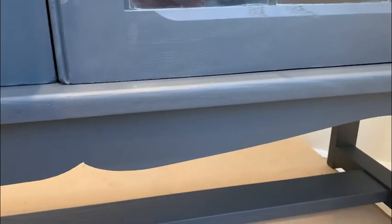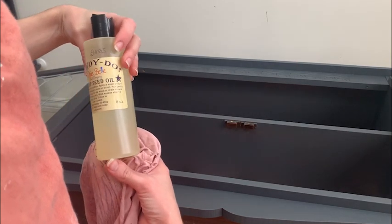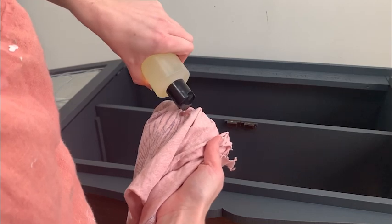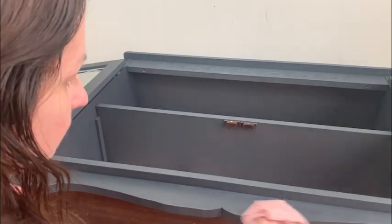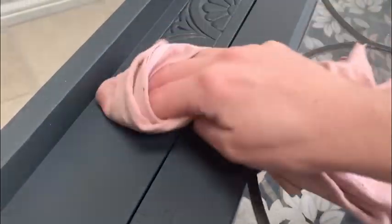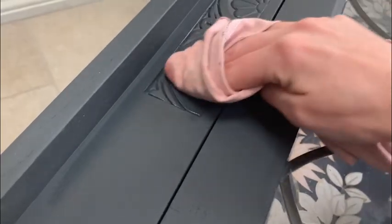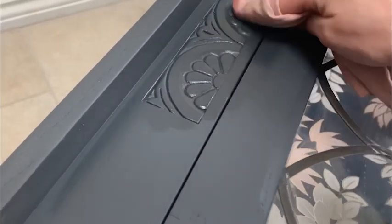While the silk range is an all-in-one paint so it doesn't need sealing, as this was my first time using black I chose a sealer that had been recommended, which is hemp seed oil. I went over the entire piece twice. I loved how simple it was to use — just add a bit to a lint-free cloth and rub it in. Any extra that hadn't sunk in after 24 hours I just wiped across and took it off. It added just a slight sheen and a bit of depth to the black, which I thought was really lovely.